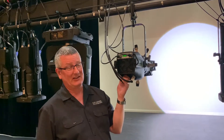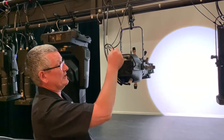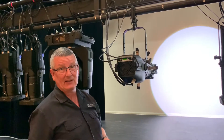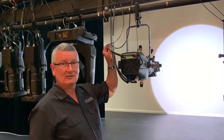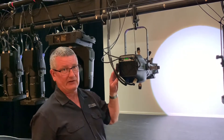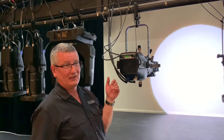As you can see, there are some extra cables — we have power in and out, but we also have what's called DMX. DMX is a control line — it's a digital multiplex, a serial control line, and I can have 512 channels of control on each line. Each one of these LEDs is using 5 channels. So for each one of these, I have 5 channels of control: dimming, strobe, red, green, and blue.